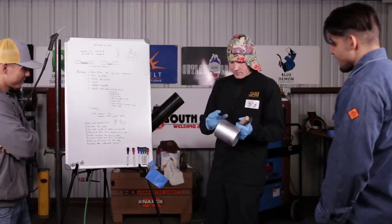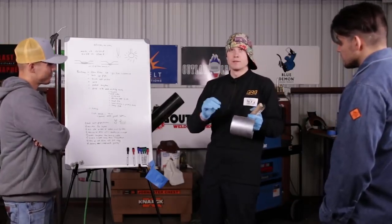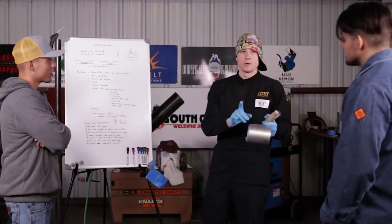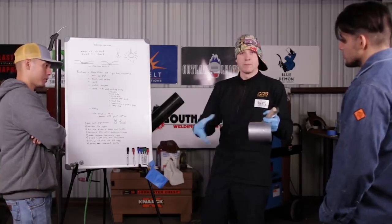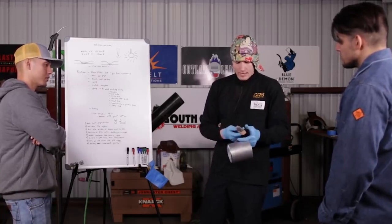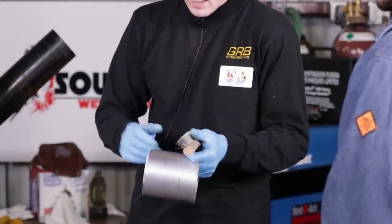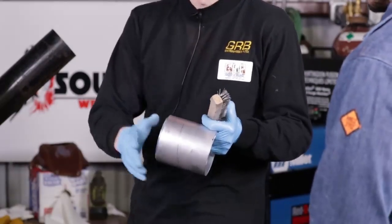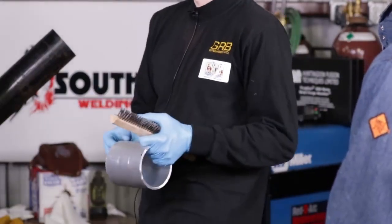But when it comes to this material, generally woodworking tools, you will not use a carbide bit, because of the speed and everything. It gums up the bit. Even a file you'll find will be gummed up. And on the stainless steel brush, a lot of the oxides will go onto the brush. But you'll be using woodworking tools: a wood router, wood chisels, router bits, etc.